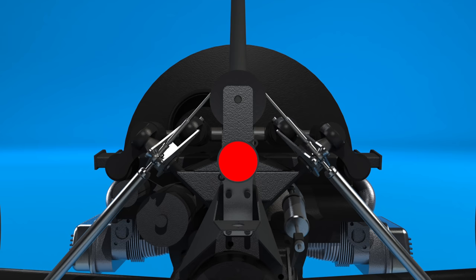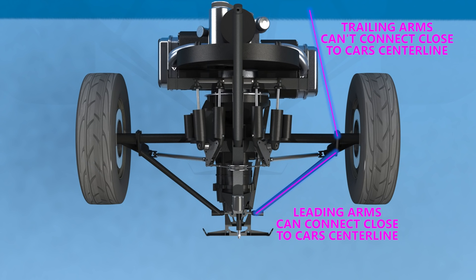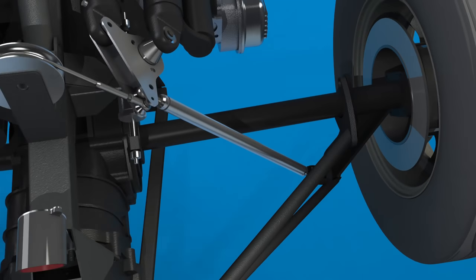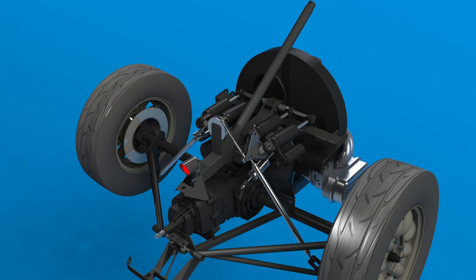This gives us the three controls I really wanted for the rear of the car. There was also the question of controlling the longitudinal movement of the wheels. I used leading arms here so that I could connect them to the chassis closer to the centre, which would reduce the change in toe angle with bump or roll. These leading arms would use two members — one connecting to the axle at the main outboard mounting plate with the other connecting to the offset mount below. This would allow the leading arms to be triangulated, reducing the member sizes. These would be taking quite a lot of force, particularly under braking, so the assembly needs to be very strong. They connect to a large rod end at the rear to allow them to pivot up and down.